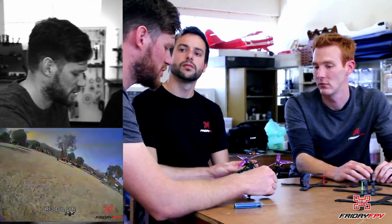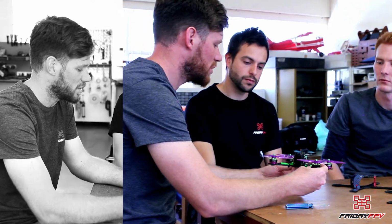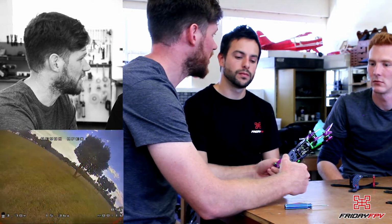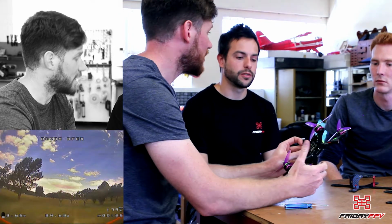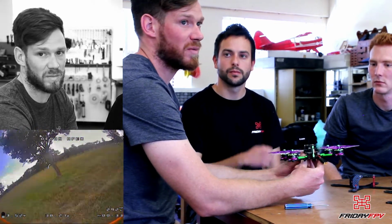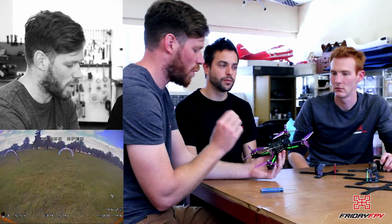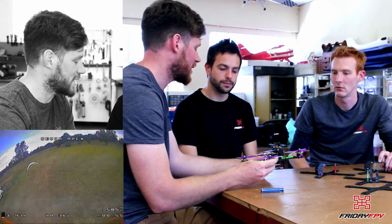Something that I like that you mentioned. Now, I sit behind a computer, CAD the stuff, and then make sure it's tough, make sure it does what you say it will do. But you mentioned reaction speed. It may be something which is often forgotten, but when you're going that much quicker, you do have to react faster, obviously. And shifting the weight of the ESCs off the arms into the center does actually make a difference. Now, I'm very hesitant when people say you get such a big difference from something so subtle, because I believe more in adding up a number of small changes which will then influence the overall performance of something. But just in that one change that we made, going from ESCs on the arms to a 4-in-1 or a center stack, really did make a difference.